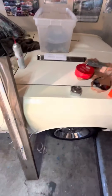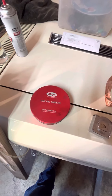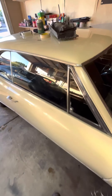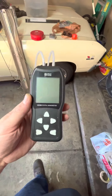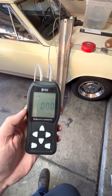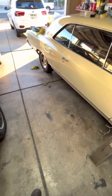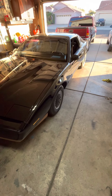I haven't used this one in a very long time. I usually use my Dwyer here — this thing is probably almost 40 years old, and it's actually the only one I use. But you can also pick up from Amazon or anywhere online this digital manometer. It measures in inches of mercury, inches of water, and also pressure differential. But I've found that even after attempting to balance the throttle bodies with the digital manometer, I go and hook up the water manometer and it's usually off by about an inch.